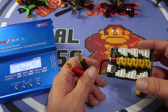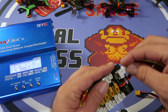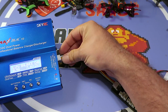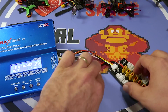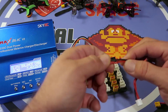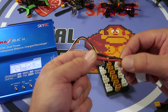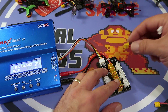Banana cables plug right into your standard charger. We're going to plug this in and see if it works. Hopefully it's wired correctly and doesn't immediately smoke the first two batteries I put in. We'll get our balance plug connected here. I connect the main plugs first because, as some people have said, if you plug your mains in first as the voltage regulates between the batteries, at least you've got the thicker discharge lead wire — the balance wire might hold up a little better. That makes sense to me.